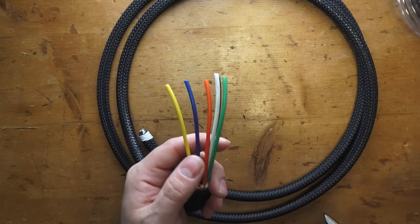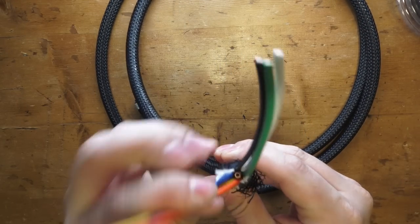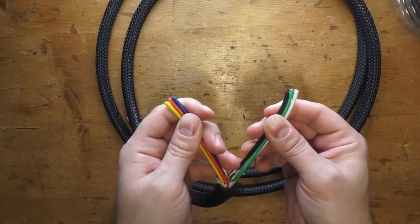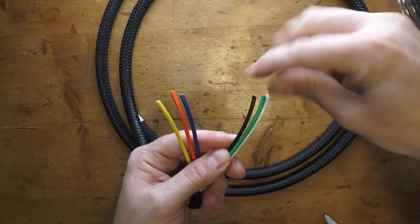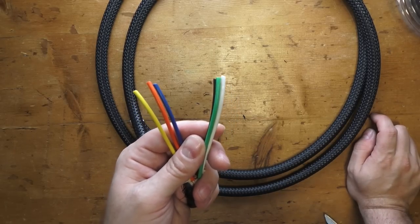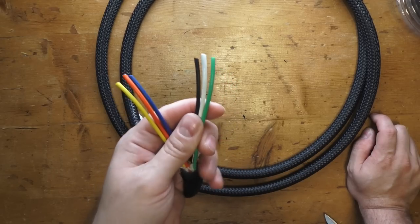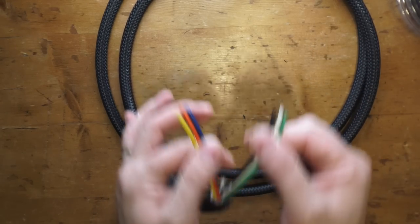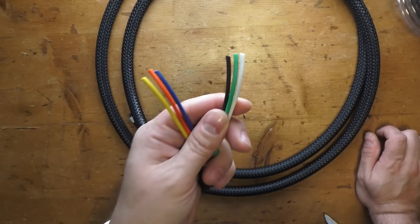Remember, don't cut a conductor. Let's try to put the air tube back in the center. I would say let's do these three and these three. It's not that difficult — we're just going to strip these now, join them together, and do the same over here. We're going to have to repeat it for all the terminations of each cable. Then we can put the red and black heat shrink, put them in the conductors, and you're ready to go. That's the beauty of cold mechanical joints and spades.